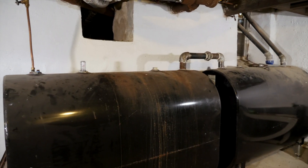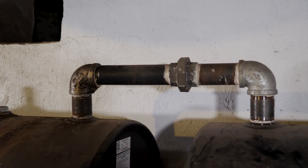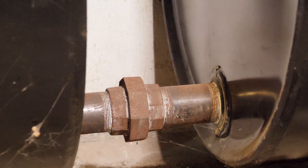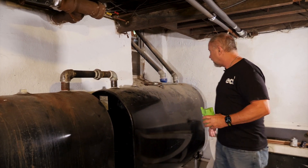What we have here today is two 275-gallon fuel tanks. This one is piped at the top, but it's also piped in two-inch at the bottom. So basically, as this tank is being filled, it just blows over into this tank and they pretty much even out.